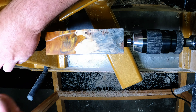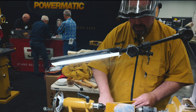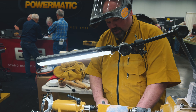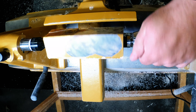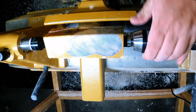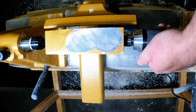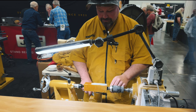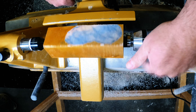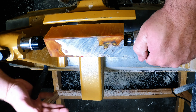Tail stock is in, engaged. Make sure it's down — push it in. Now we're going to set up our banjo and our tool rest. We're going to make sure we're right at about center level. Spin it around — always make sure you spin this around a few times. Last thing you want is to have it set up, turn your lathe on, and hit. It's very important to make sure you've got plenty of clearance. We've got clearance. We're going to engage our tail stock, make sure everything's good and tight.